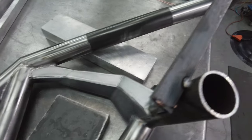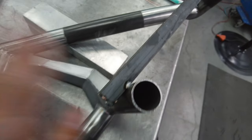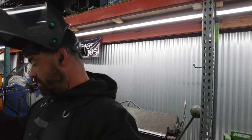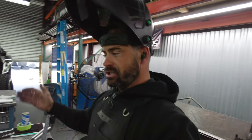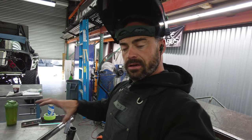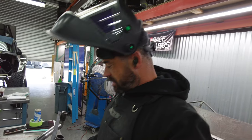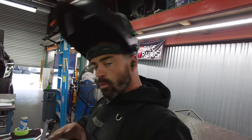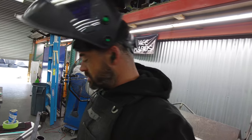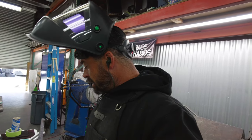I kind of have my block set up for hand placement and comfort, and then this is also kind of a prop to not have this thing teeter-totter. Every little movement, once you're welding, even just moving your hands is one thing, but also the part will start to kind of chatter or vibrate sometimes through the arc, and you just want to stabilize everything the best you can. Especially if you're leaning on this thing or putting pressure while welding, you might not even know the thing will start moving on you, and then obviously you're gonna scratch your weld. So that's that.